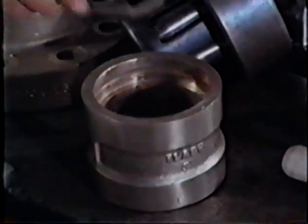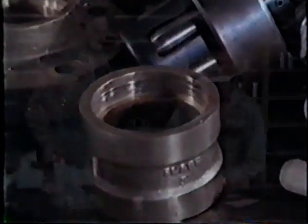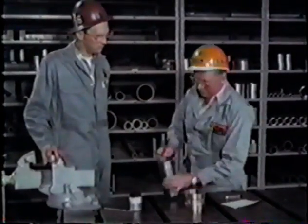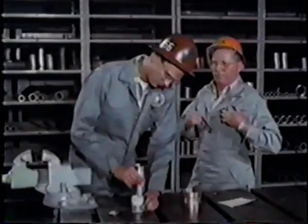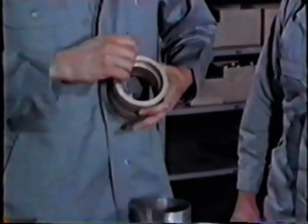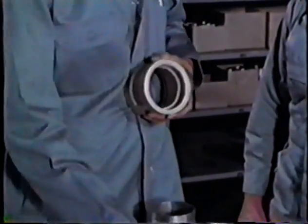Clean the alloy rings to bright metal and wipe. Install the alloy rings. Apply flux to all surfaces immediately after cleaning. It protects them from oxidation and scale and helps the alloy flow properly. Brush on the flux with a circular scrubbing motion, leaving no bare spots.